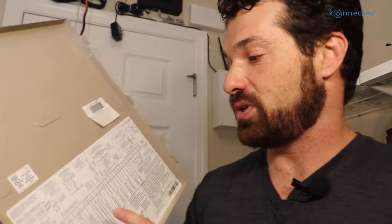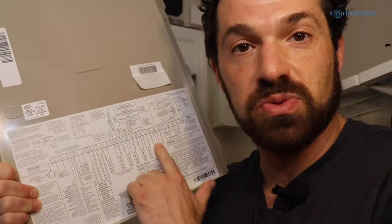This is just going to take about 30 minutes to an hour and a half, depending on how many sensors you have and how difficult it is to figure out which one goes to which. Your first step, before we touch anything, is take a picture of the existing alarm system so that we know how everything was hooked up before we started. Then we're going to figure out which wire goes to which sensor and label them.